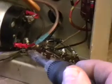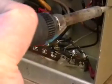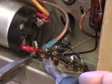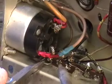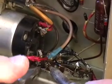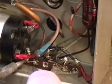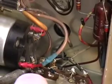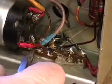Now, this modification is necessary because if you leave the 180 k ohm resistor in there, what's going to happen is you're going to send 120 volts AC into the LED and into the chassis ground, if there is one. And it's going to light pretty much permanently. So again, we're going to add this jumper in there, and that's going to put 36 volts onto that brown wire, or what used to be a white wire. It's now brown from age in the harness.